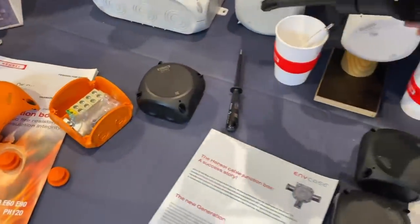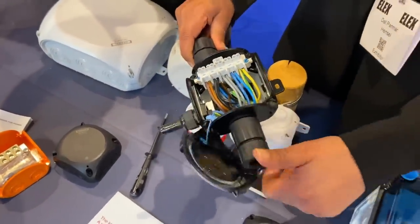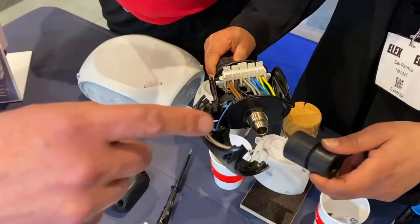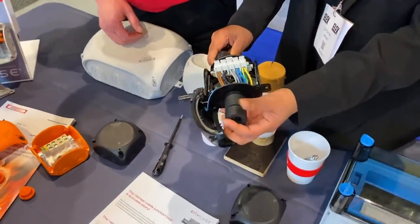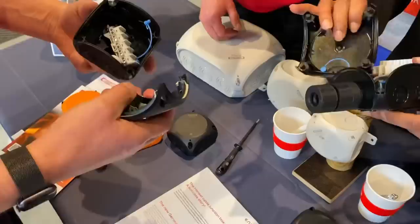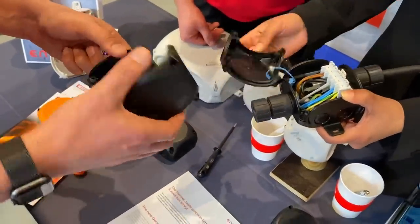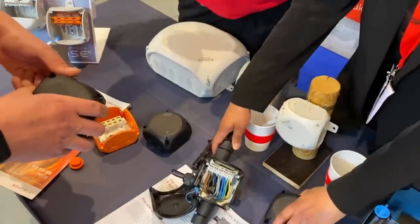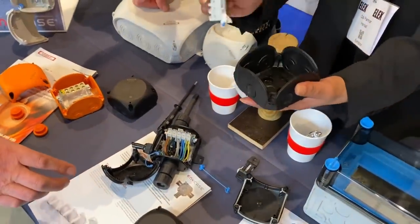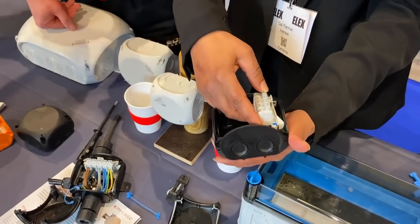If anyone's using an SWA gland — oh, that's good, that's clever. Captive washer. You sell that to the SWA? We do those as well. With our box, we give you a little lid retainer so it doesn't fall off while the guys are working on it, especially at height. You don't want to go down your steps and find those in pieces. With the connectors, you can choose where you want to put them — if you've got cable coming in over here, you can fix it to this side. You can have two terminals — one here, one here. You don't need two boxes.